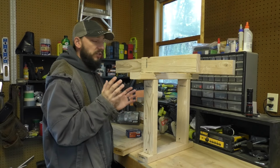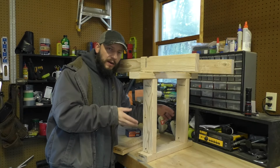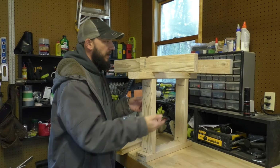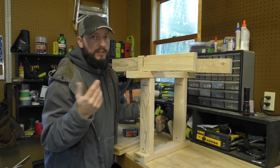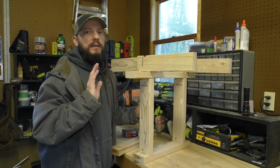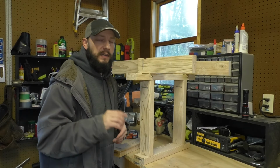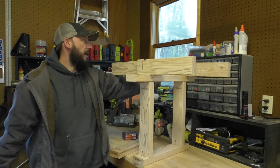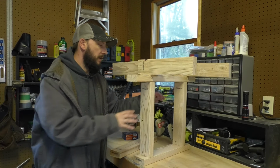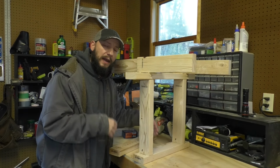Whatever the case, it's very important to support this, because if you go and cut these 2x4s, not just for later on down the road, making sure you have the proper header, but while you're doing the job, if you just cut those, this could obviously sag, or worst case scenario, it could collapse. You don't want that. So while you're doing this project, the first thing that you could do is build a temporary wall on this side and on this side of the wall. Cut these out, put the header in, support it properly, however you need to.